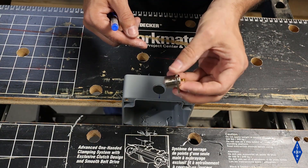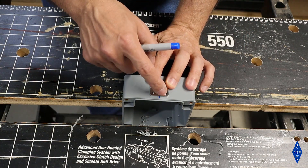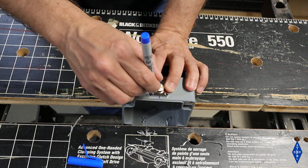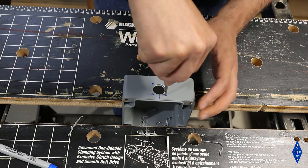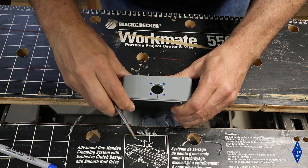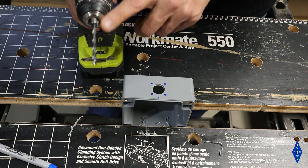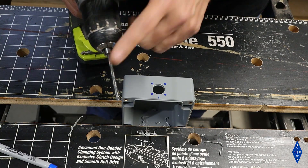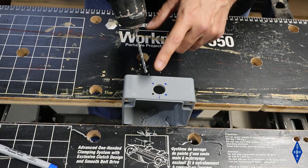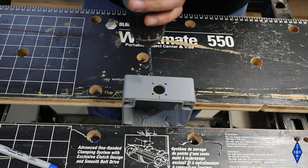Next I'm going to grab the SO239 connector, put it upside down in the hole, line it up so its edge is parallel with the edge of the box, and then use my marker to mark the four corner holes. I'll use my center punch to make a little divot at each hole so the drill doesn't wander. Now I'll drill these holes out using a 3.5 millimeter or 9/64th diameter drill bit. If you have old worn out drill bits you'll want to drill at a slow speed to keep the plastic from melting and the hole from burring up.